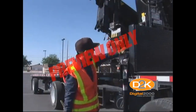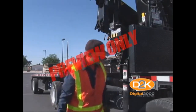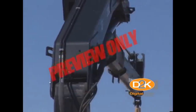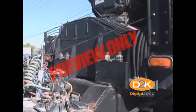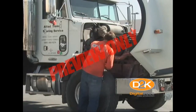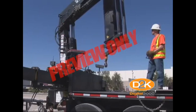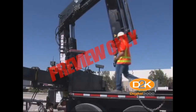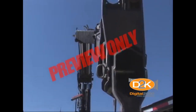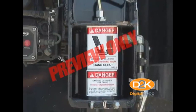Carefully check your crane for damage or anything else that can affect the operation and safety of the equipment. Look for leaks from any hose, fitting, valve, or cylinders. Report any exposed, abraded, or visible wire hose braid to your supervisor. Look at the steel structure for any visible cracks or damage. Check the mounting hardware tying the equipment to the truck bed. Ensure that the oil tank has the correct amount of hydraulic oil in order to operate properly. Check that all levers and remote control systems are labeled and operating properly. Take the time to operate the crane to ensure that all components are working properly. Also, run the boom in and out a few times to ensure that all systems are operating properly and fluids get moved throughout the system. Be sure that all warning and other instructional labels are legible; if worn, report this to your supervisor for replacement.